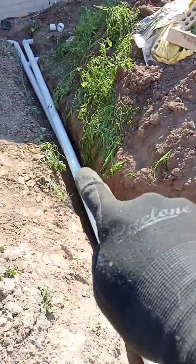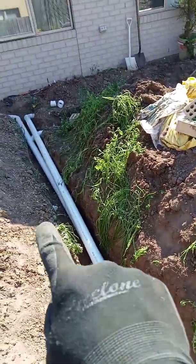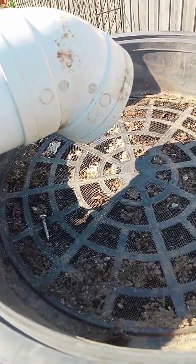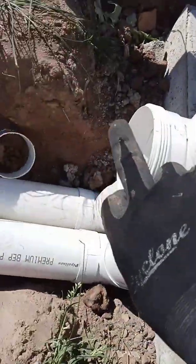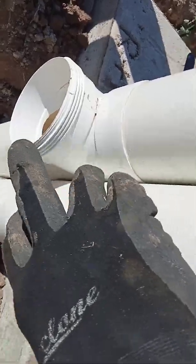There's a 90-degree angle here, and then this is the overflow. That's on top of the pipe that's bringing the water into the tank. The water coming in is heavier so that pipe is underneath. We've got the water coming in up here — that's just a 45-degree angle going into the tank. And here we've got this piece where we can open the lid and flush it out so all the leaves, gunk, mud, or debris can come out.